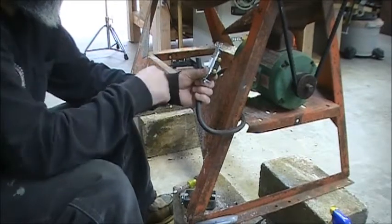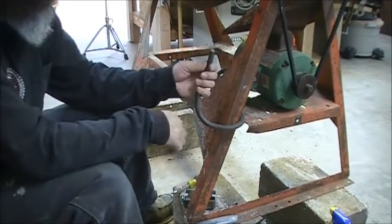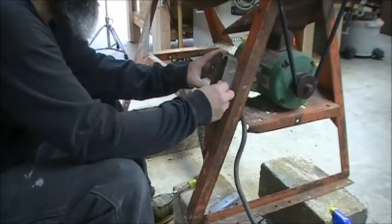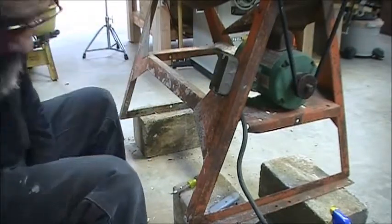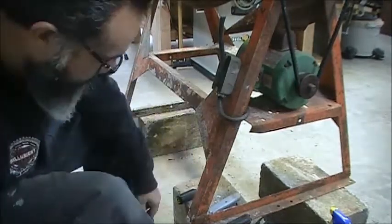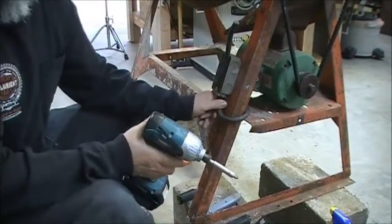And then you have power. And you turn it off. Right? And the neutrals, they get tied together. They don't get switched. You never want to switch the neutral. You want to always switch the hot. That ain't going nowhere.